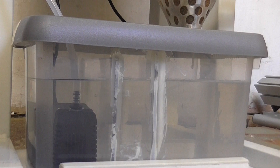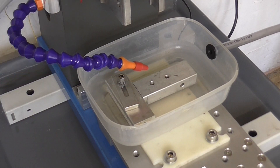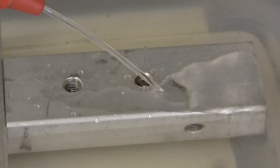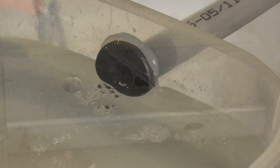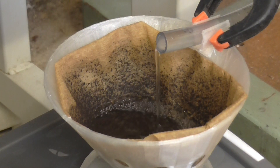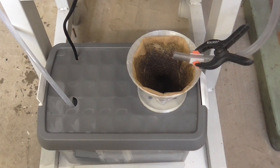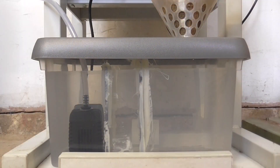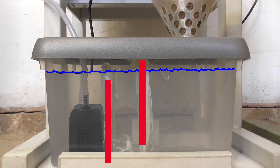At the bottom of the machine is a tank of distilled water with an aquarium pump inside. This allows a constant stream of water to flush the work area. The water exits through an overflow pipe and goes back into the tank via a filter. I'm using simple paper filters for now, but they get clogged and need changing often. Inside the tank are also two baffles to separate any material that gets through the filter.